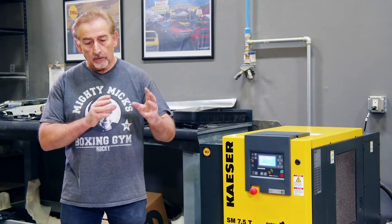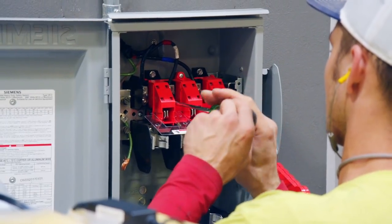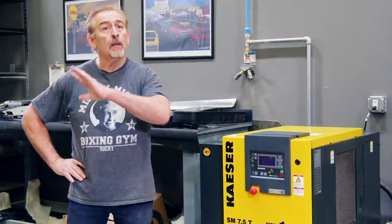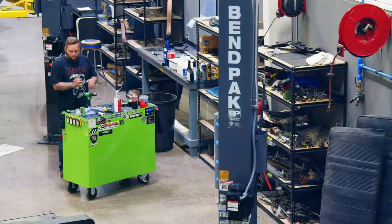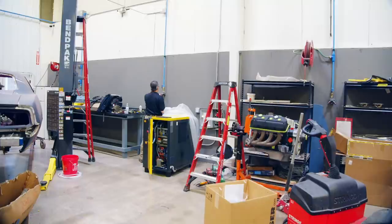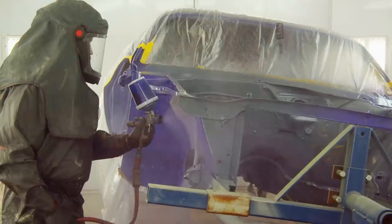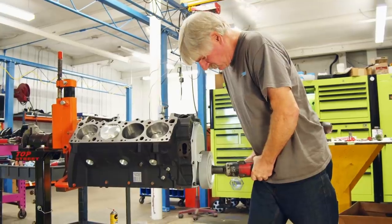When we moved into this building, we put in two brand new seven-and-a-half horsepower rotary compressors. We ran a one-and-a-half-inch main line completely around the inside of the building — mechanic shop, upstairs, downstairs, up in the parts room — a big 360. Off that 360, there are drop-downs every 15 to 20 feet with a plug-in or nipple to connect an airline into. But we now have five body men, a painter, and two helpers plus the mechanic shop. We're running low on air, so this is just an addition — a constant growth pattern for Graveyard Cars to make sure quality and speed are never compromised.